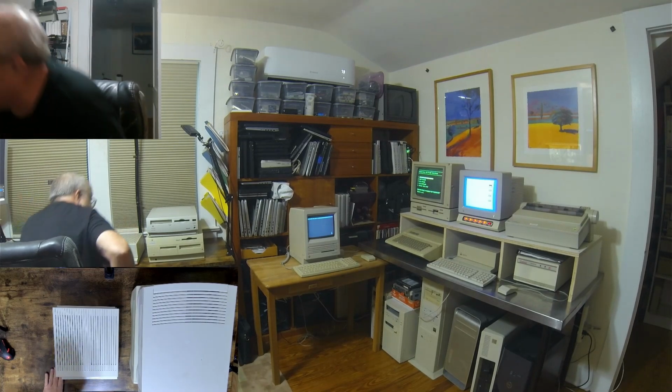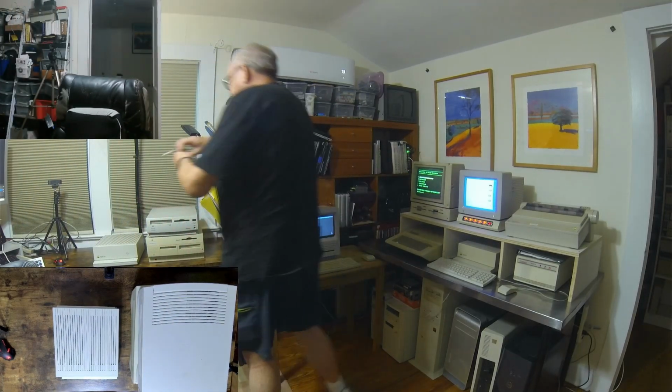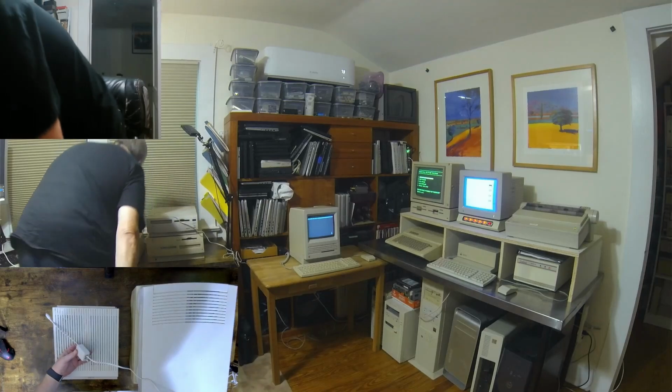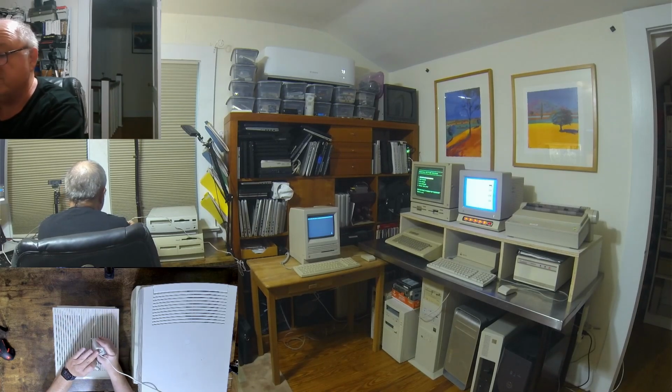One, obviously, is the physical connectivity. And that's done by adding another AppleTalk connector, or in our case, PhoneNet connector into the network. And in fact, I have one here. I touched on this briefly in the history video. AppleTalk, Apple themselves provided these kind of boxes with two ports on them, but they used a more proprietary cable with a DIN 8 plug in it.